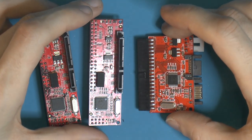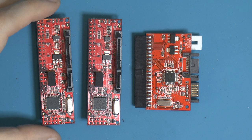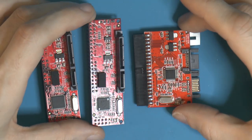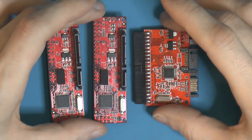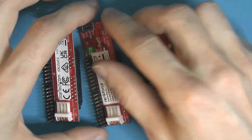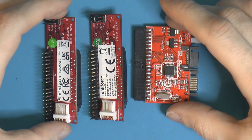To connect the SSD, we need some way of connecting it. I usually use SIL3114 SATA controllers, but this motherboard hates it. I tried three different ones. They are basically the same, but with different BIOSes. With one of them I can run Windows, but I can't install from the optical media, no matter if it's connected to the controller card or to the IDE controller of the motherboard. It causes issues, and I've seen this before on other motherboards, so it's a compatibility issue with the BIOS.